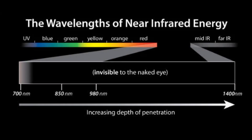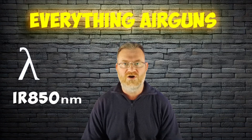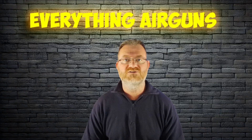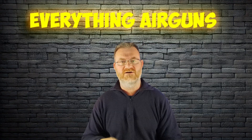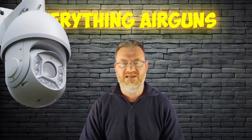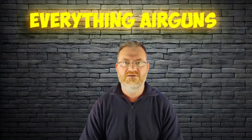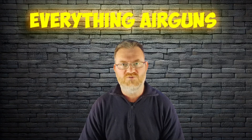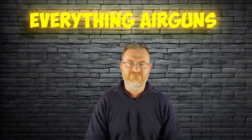Now there are different types of infrared light. Today we're going to be focusing on two of the most popular used for night vision: the IR850 and IR940. First up the IR850. The 850 refers to the wavelength of the light that it emits — 850 nanometers to be exact. In simple terms this wavelength is just outside the visible light spectrum. It's a bit more powerful and gives off a faint red glow. You might have been walking through town and noticed security cameras with a dim purple-reddish glow underneath — that is the emitter shining the light for the camera to see. Because the IR850 is more powerful it can reach further distances, so the range is greater and it's brighter. If you need to spot something far away in total darkness, IR850 is your go-to.